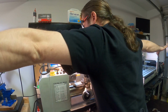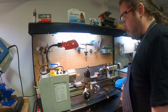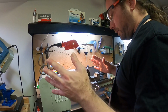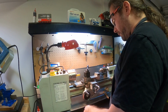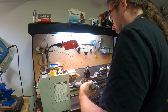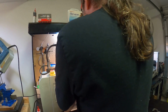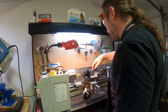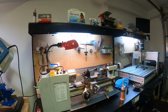So you've got your two arms. Each one of those arms goes into the hole that's in one of the two coils. The two coils are inverted polarity. If they're not inverted polarity, that system won't work. It's super important. Otherwise, you won't get the flux and balance correctly, and the armature won't shift.